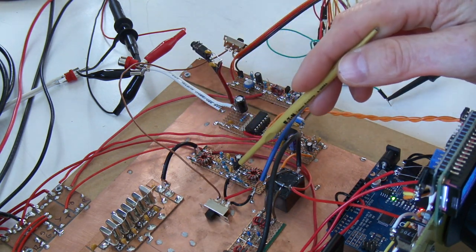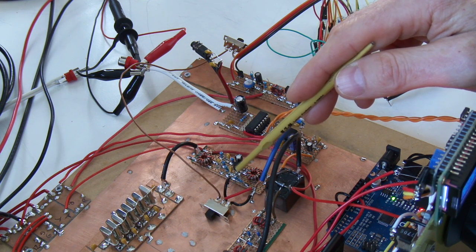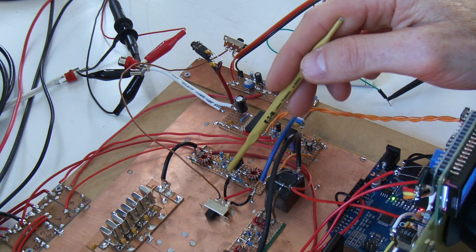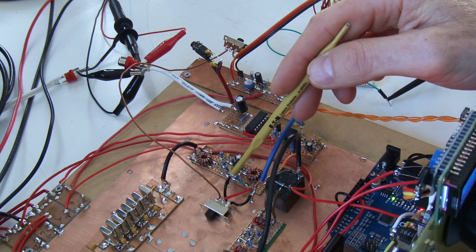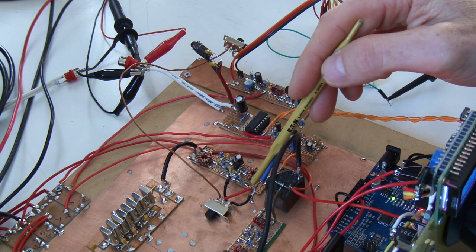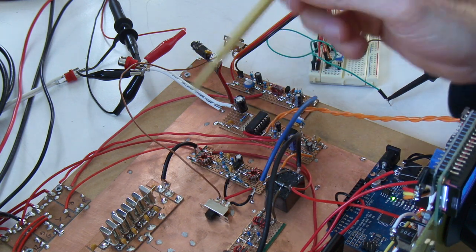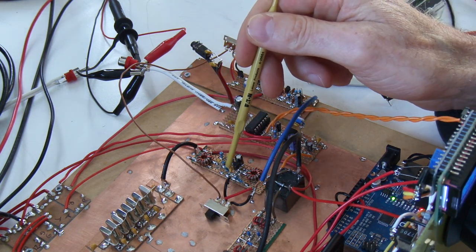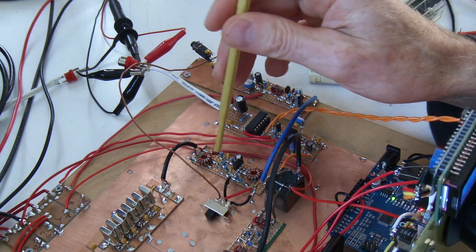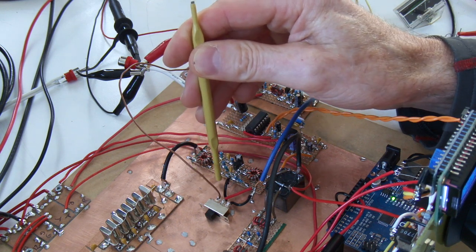And what I've done here, and you'll see it in the schematic, is I've lifted the capacitor that is bypassing the emitter resistor of that particular amplifier, and I've got going from that leg to earth a small 4148 diode, which is being fed a DC voltage through this 1k ohm resistor. The whole idea is as more voltage gets applied, the depletion zone decreases. That capacitor that was there gets more attached to earth. It's a very poor way of saying it, but a better way of saying it is the emitter resistor becomes more bypassed, and therefore the gain of that stage increases.